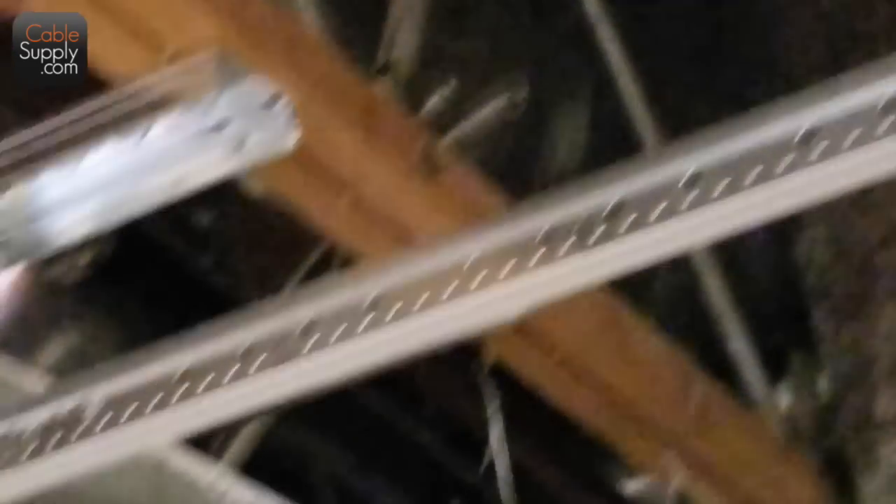Here's a pony wall — you're going to have some data down there on your pony wall. This one sort of snakes out under the wall, so the electrician was nice enough to put a flex stub-out in for us. Under the main counter for checking in patients, they have it coming up right here in the corner. When you're looking to design something like this, if you're an electrician, you better have the stub outs in place, or you put the cable in before the drywall. You always want another path because maybe in the future you want to upgrade that cable — you have to pull it out and put in the new.